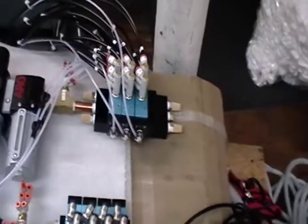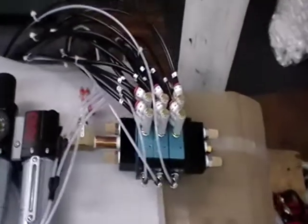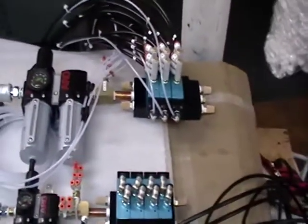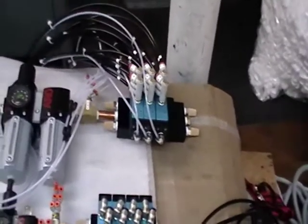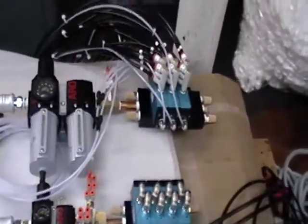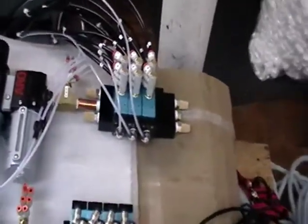The four-way double pilot valves here are all started and sequenced at the same time, but they have independent return. We also hook a limit switch on each unit and have the groups tied into series. This makes the pneumatic control more cost effective to buy without needing a four-way spool valve for each unit.